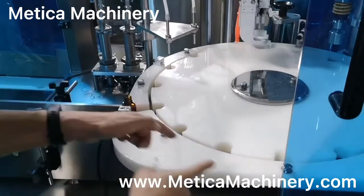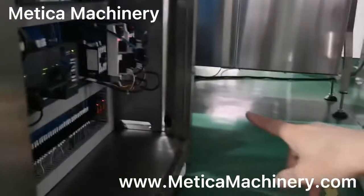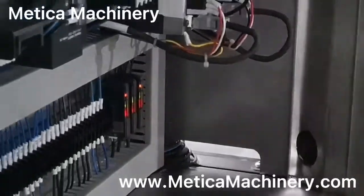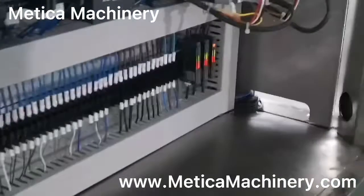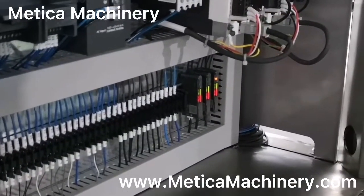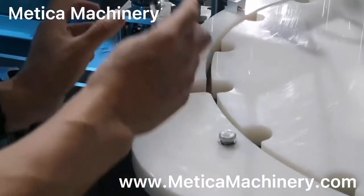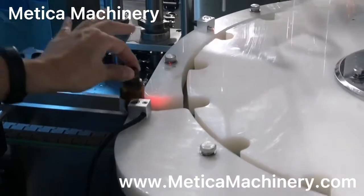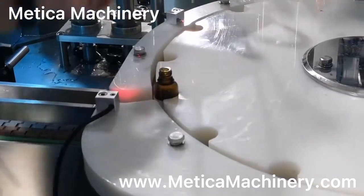Okay, here the sensor is inside that one. You can see two indicators are on. One is for the bottles over there. Now this is the sensor for the bottle. This is the sensor from the bottom. That means we need to adjust the sensitivity to make sure it works. When the bottles come, it can detect the bottles.